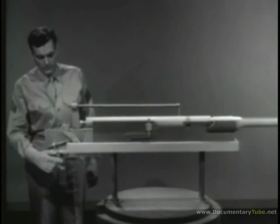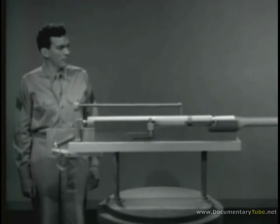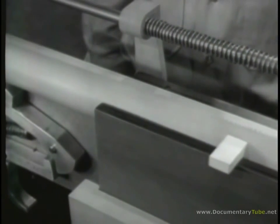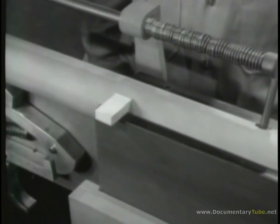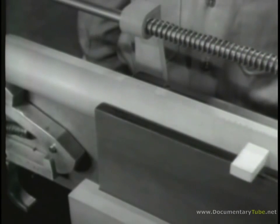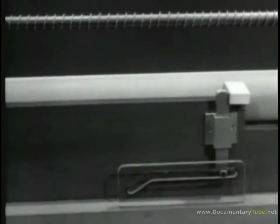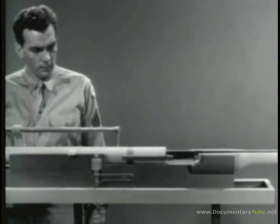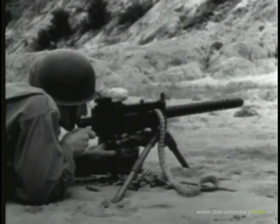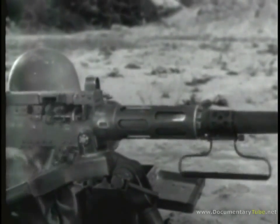Let's watch the action again. As the bullet moves out of the barrel, recoil begins, driving the barrel and barrel extension back, and the bolt is unlocked. When the barrel extension is stopped, the bolt continues back. When the bolt is fully opened, the return spring takes over — it first pushes the bolt closed, then the catch slides up the slot and locks the bolt. The return spring continues pushing until the barrel and barrel extension have reached the forward position. Recoil operation is used on such weapons as the pistol and machine guns. If you see the barrel of a weapon moving back and forth inside the receiver during firing, you can be sure it's recoil operated.